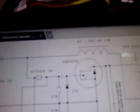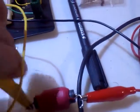On standby, it's drawing very, very little amperage. And it's good to have this little inductor here, which I will actually include in the circuit. It's actually quite important to have one there. If you don't have any — let me just short it — it still works, but look at that amp draw. At 6V, I'm standing at almost half an amp with no load.